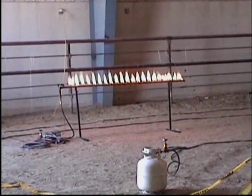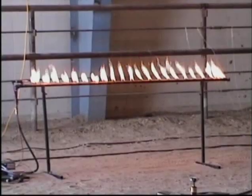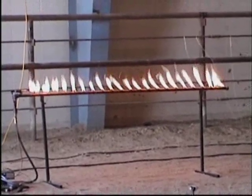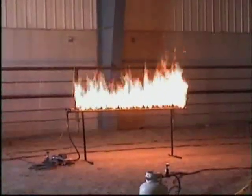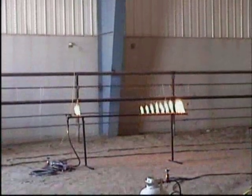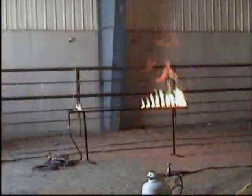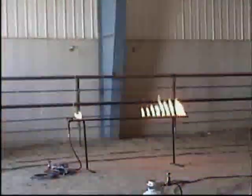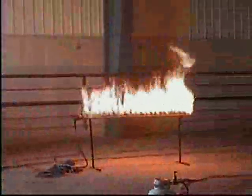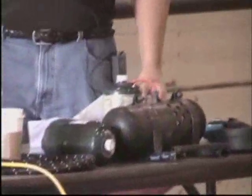That's regulated pressure off of there — small flame — and we could raise and lower it. There's another valve that bypasses the regulator, which just gives me tank pressure. Height-wise, that's all you're going to get vapor-wise out of a tank. If you're using it in a shell for some kind of reveal, you can puff it and it kind of looks cool. It's pretty basic control. And if I did this for a while, under this I'm going to freeze that 20-pound tank — if I just left this on, it would freeze.